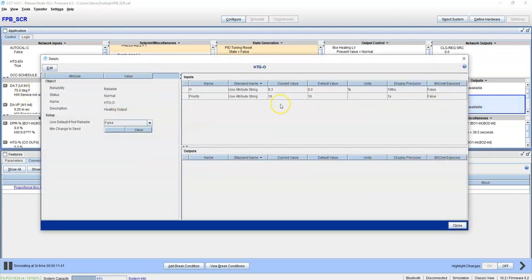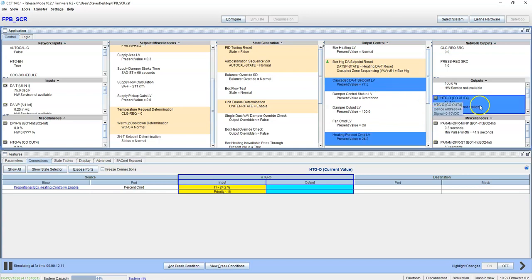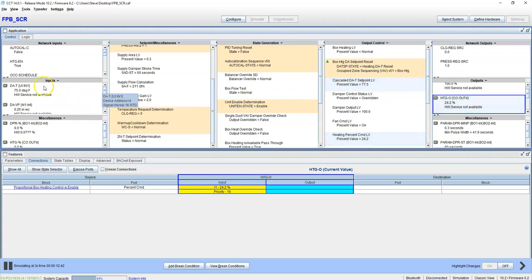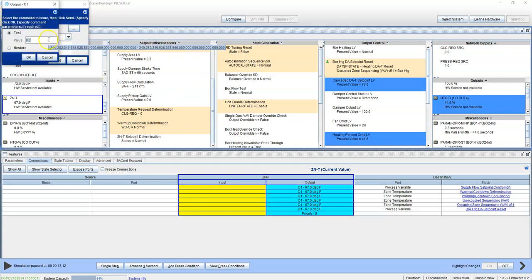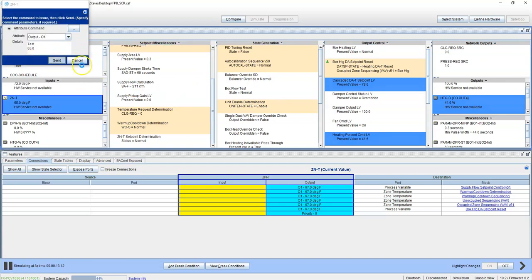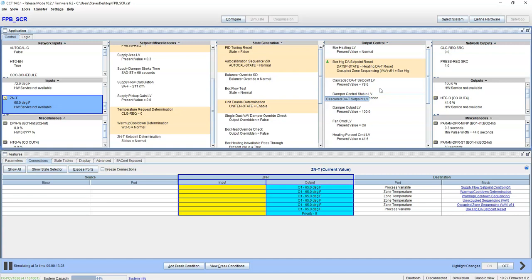And we have this set up for 0 to 10. So if your SCR is 0 or 2 to 10, then I'll show you how to change it here. As you see, all this is working here. We go farther from set point. And I'll show you that the set point will never be above 95 because that's what we set in there.